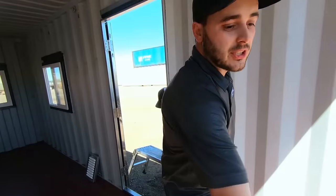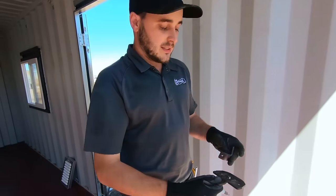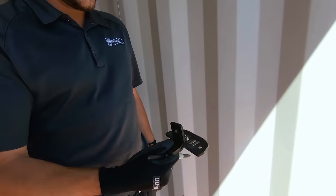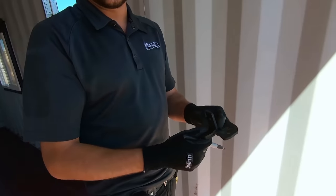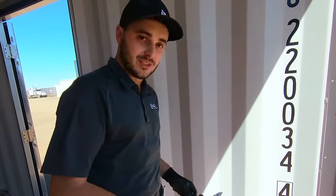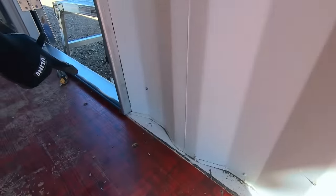In this container, rather than a steel stud frame, we're actually going to be installing our CSM brackets. These allow us to install strut channel on the inside corrugations. Right now I'm just marking out the container — trying to figure out where it's best to put the strut channel because we have so many windows and doors. We want to do about every second corrugation, so we'll do one here, another there, and now we're at our man door.